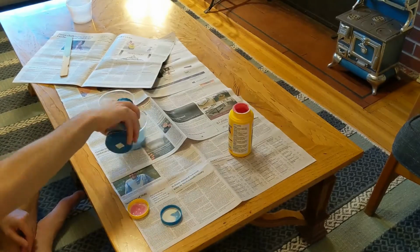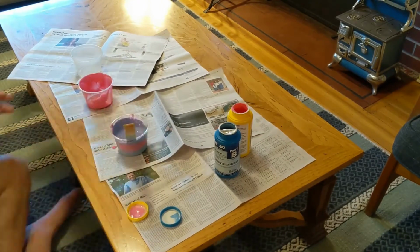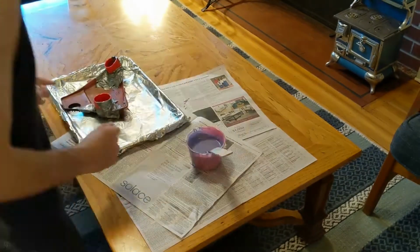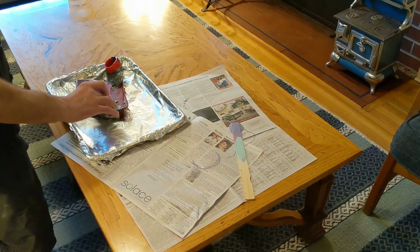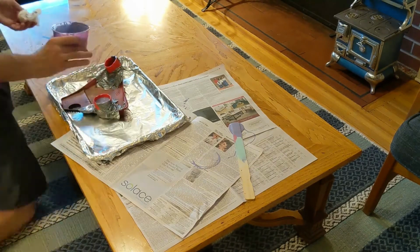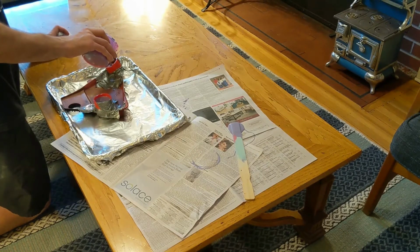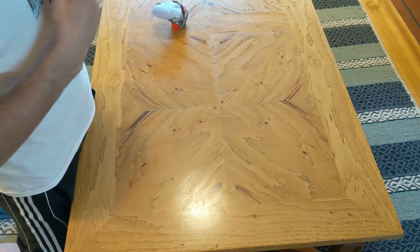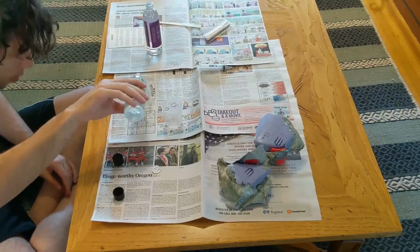The first step is to mix the silicone and pour it over the pins to create the molds. After this sets, you carefully remove the silicone molds and mix the epoxy resin. I used a syringe to inject the resin into the molds.